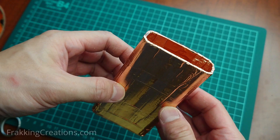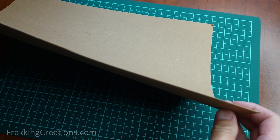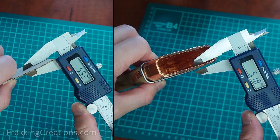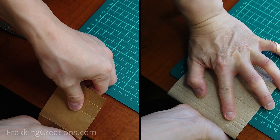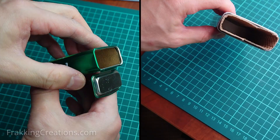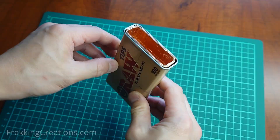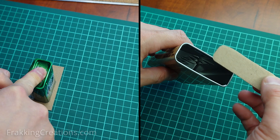To make this little Faraday enclosure, we are going to upgrade the shielding capabilities of the tin box by putting in a shielding liner. The foundation of the liner will be cardboard. You will have to choose the thickness of the cardboard to get the desired result to fit your key fob. Note that lining the cardboard with shielding tape will result in a liner thicker than the original cardboard. Measure, trace, and cut out the cardboard and perform your test fit. It may help to bend and curve the cardboard using a ruler and an edge of a desk so that it can form the shape of the tin box easier. Make sure to test fit everything nicely before adding the shielding tape or you may end up with a liner that doesn't fit. The side and bottom pieces are made and shielded separately, then later joined together using shielding tape.